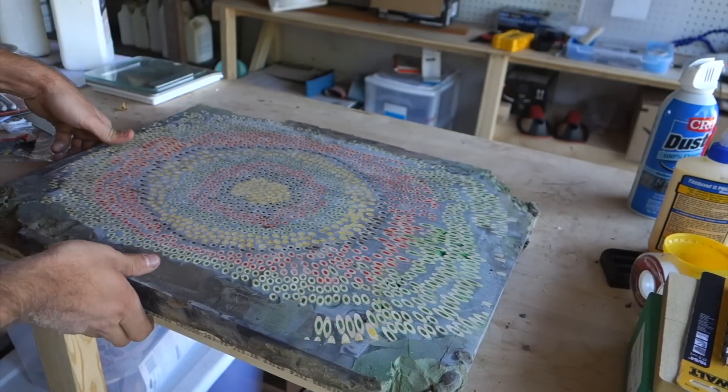The top is cured and I just flipped it over, cut out the pink foam, and now I've got a nice little lip covering the entire bottom. I'm going to do the same thing to this side as I did to the top. I thought I'd be able to just rip off the plastic from the sides but the resin cured to the foam, so I'm just going to grind through it. Now I've got the edges rounded over and I've got to re-route the cavities again. I'm using a bottom bearing template bit cutting only about an eighth of an inch of resin, so it should be pretty quick.